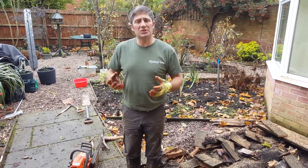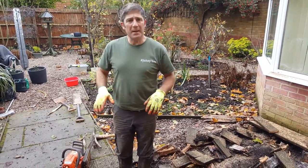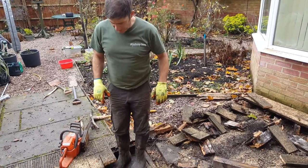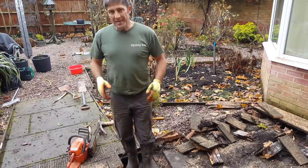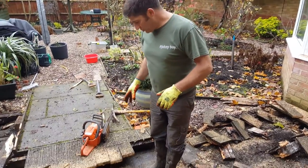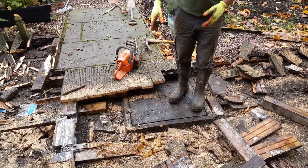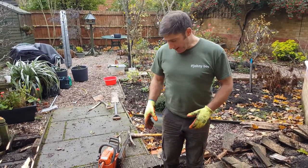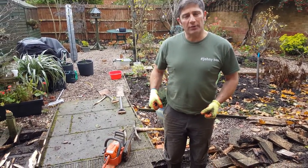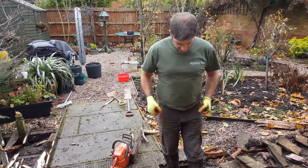I've mentioned about the membrane and the chippings and keeping the stud work out of the damp area, but the one thing they've done here is that they've decked over a manhole cover. There has been an attempt to put some sort of door in here, but even with the door that they put on there, you wouldn't get it up in a hurry and you wouldn't have been able to get the manhole cover off. There wasn't enough room and it's not suitable.